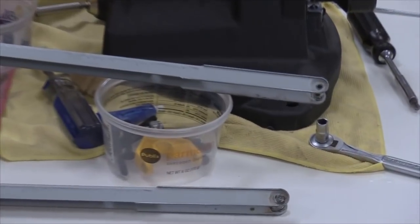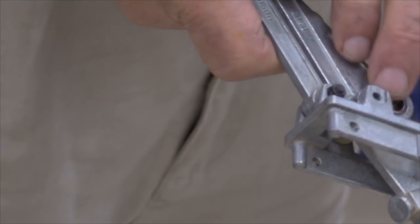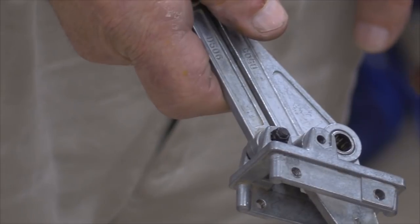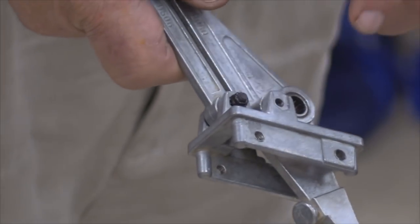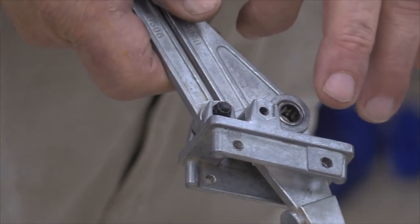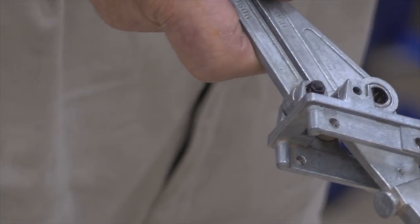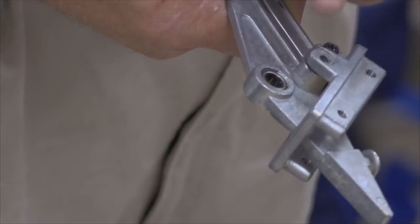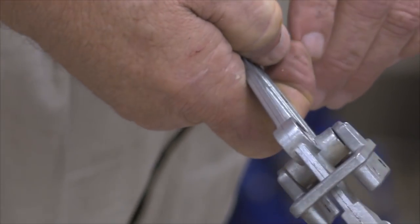Yeah, Buzz, zoom in on that. All this is a piece of stamped sheet metal. Where that thrust washer goes is right over this bearing right here. And then a sleeve will go through that. One on each side? One on each side, yes. So the idea is, and you got to hold your mouth right in order to get this done, you put the sleeve in there. The sleeve is actually wider than this part. So then you got to put some grease either on this surface or on the washer or both, and put it down over that little piece of the sleeve that is sticking through. So that one will usually stay there. Flip it over, you drop the thrust washer down on the other side of that one, and then hopefully they will stay there until you get the thing put back together.